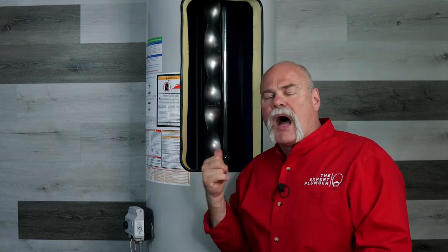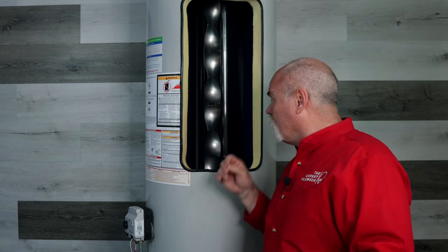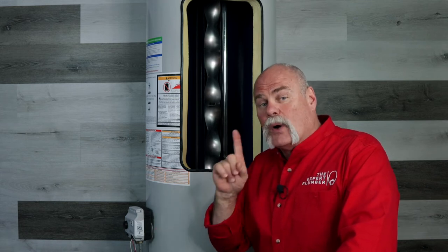On the backside, you've got the anode rod. What I like about the Bradford White water heaters is the anode rod and the hot water outlet are the same thing — where you tie on at the top to get your hot water out is attached to your anode rod that comes down and has two holes in the top. The anode rod is sacrificial — it's made of magnesium or aluminum. Over the course of about the first year, any little pinholes, cracks, or breaks on the inside of the water heater, the sacrificial anode rod will dissolve and go plug that hole.